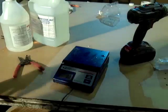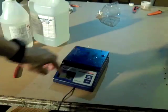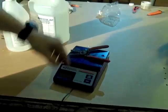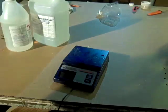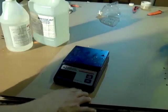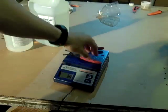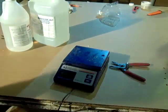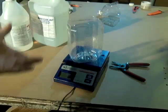One of the important things when you're mixing resins for any type of pouring is that you get a scale. This is just a cheap post office scale. You're going to notice there's some resin on there. All of these scales, when you turn them on, they zero themselves out. So if I put those pliers on there and turn it on, it's going to go to zero. When I lift it off, it's going to be minus 3.8 ounces. Now if I shut this off and turn it on, I guarantee these are going to weigh 3.8 ounces — and they do. So it doesn't matter that you have a little dried resin from a previous job up there. If I put this container on there, you have to figure 1.8 ounces for the container.